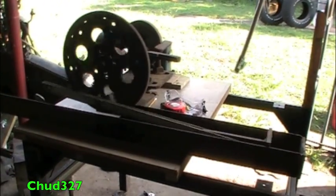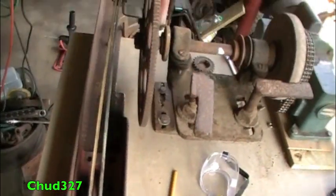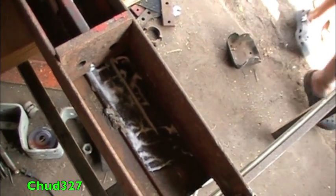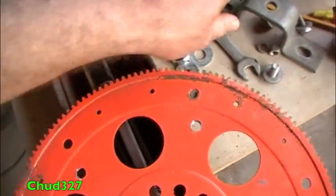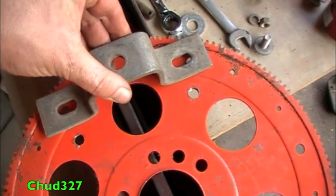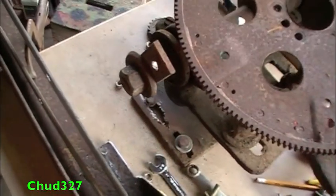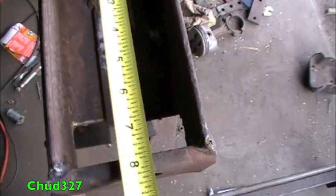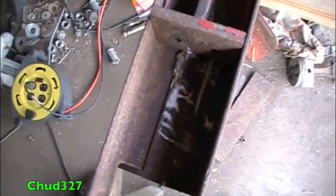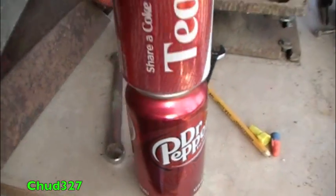This thing opens up about ten inches and I don't think there's a ten-inch can out there, so I want to go to the other flex plate — the smaller one. It'd be less travel and more crushing power. On the smaller flex plate I went ahead and drilled two holes closer in to make it an even shorter throw. More throw equals less power, so I'm trying it down here. The smaller updated flex plate opens up to about seven and three-quarter inches — over two inches less throw, which is going to increase our squishing power. These two volunteer cans are ready to roll: Miss Mock gave me one and that was my own — those are from lunch.